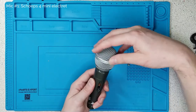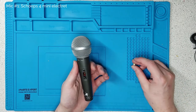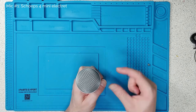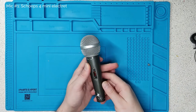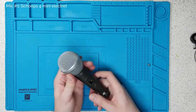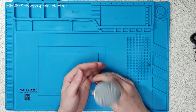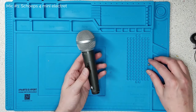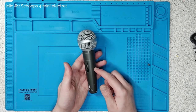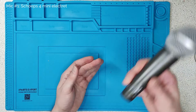I have taken the switch off because I didn't really see the point of putting a switch on a phantom powered microphone. If you switch the thing on and off, you just get a big thunk as capacitors charge and discharge. The nice thing about this mic is because of the way I've suspended those capsules on that little PCB with two very fine enamelled copper wires, the handling is great. So it doesn't make much noise if you move it around and bang it around. This is really good if you want to be handling a microphone on stage but want the sensitivity and frequency response of an electret condenser microphone.